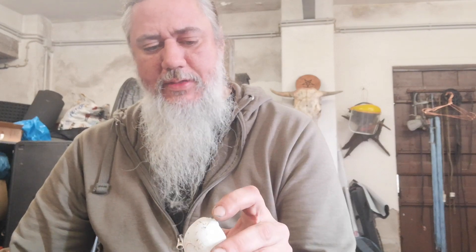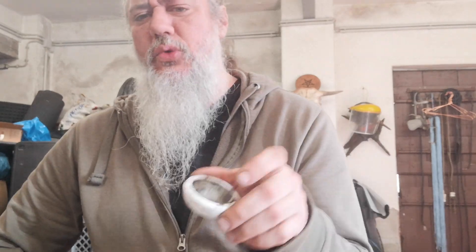Surprisingly, this held up — I was pretty skeptical with cheap stuff from Amazon, probably made in China. I couldn't find any info on anyone using it in a forge. With a melting furnace, the flame comes from the bottom of the crucible and there's a lid on top to hold the heat in. I ended up putting a fire brick over the front of the forge to keep heat in. I also tried not to put it directly under the flame — I put it back behind the flame, using just one burner, to avoid direct flame and help with oxidation.